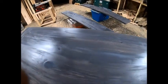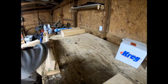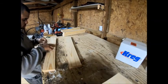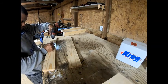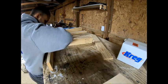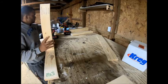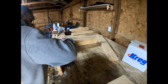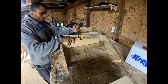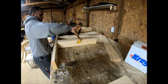Going into the next step is the base of the table. However wide your table is, I usually go four inches in — two inches on each side — and that's how I figure out how wide I need the base. So if this one was 36 inches, I'd make the base 32 inches wide. A typical kitchen table height is 30 inches, so once you start subtracting your top at an inch and a half, the long piece eventually came out around somewhere 18 inches or so.